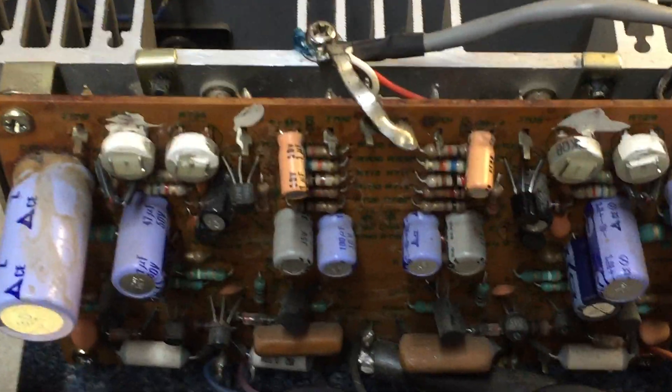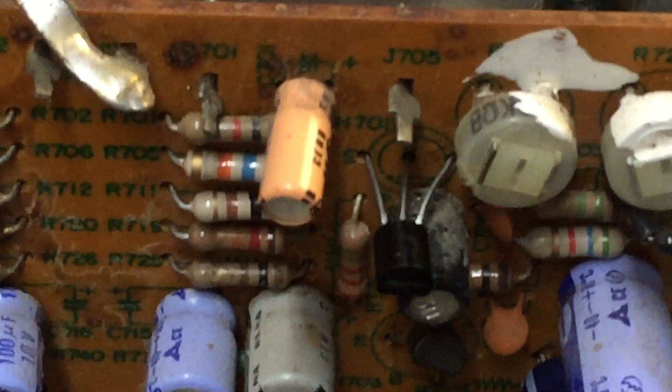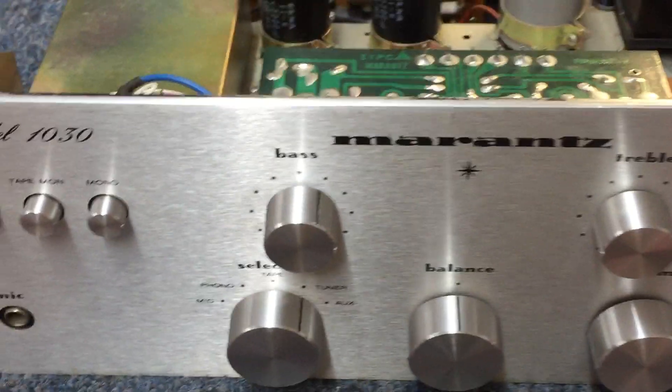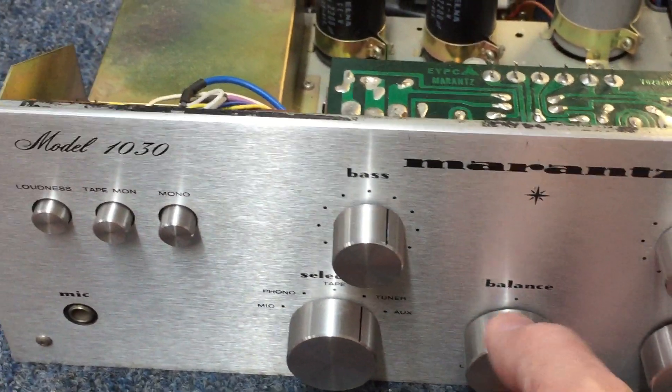Taking a look at the board completely reinstalled back to the heat sink. Got the diode back in — did not snap off a lead, which is a good thing because I'm sure that part is not possible to obtain any longer. There's our 2SC945, and tucked down below is the 2SC1318. On the other side is the cap that was tagged in, and there's our side with the cap we put in. Everything's looking pretty good as far as the circuit board is concerned. Let's fire it up — I know it works because I've already tried it. Left side, then the right side — exactly the same.